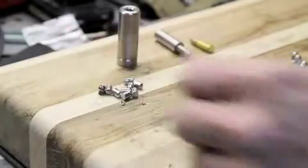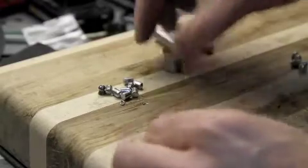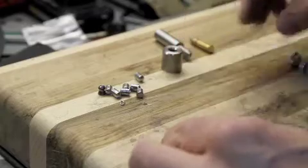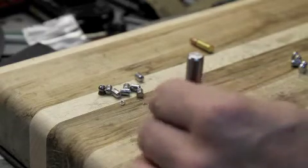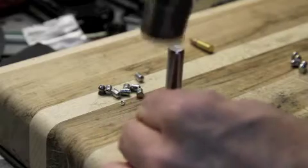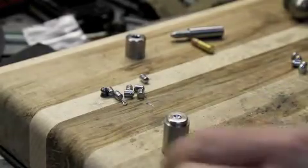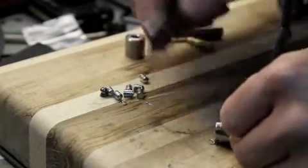Now what we're going to do is we're going to forge a pellet. We take this little tool — I found this online. Just search pellet casting or .22 caliber pellet casting and you'll find it. It's a guy over in Great Britain that creates these, and it actually came pretty quick — only took about two weeks. So we put that together and give it a couple nice smacks with the hammer. We pull this apart and there you can see our pellet is forged in there. We're going to take a razor blade and trim the top of that pellet off.